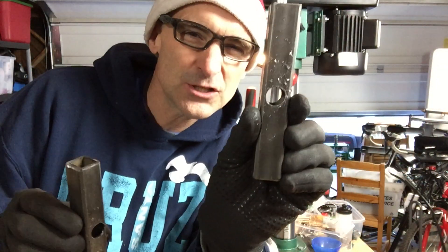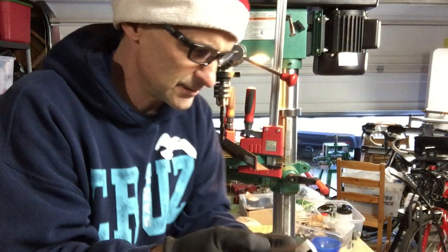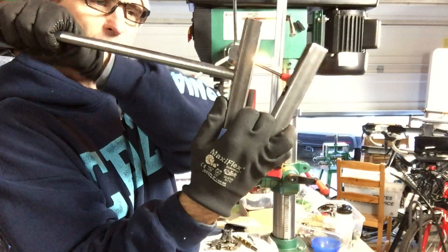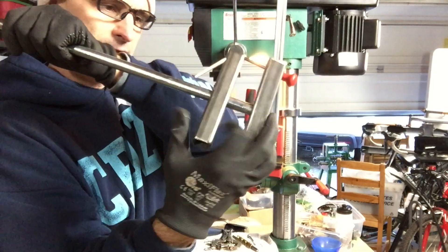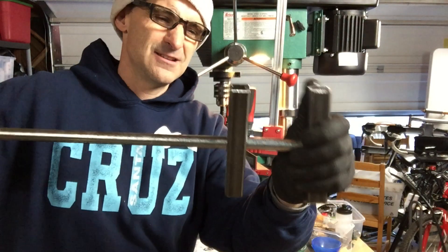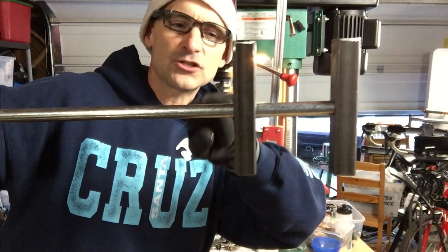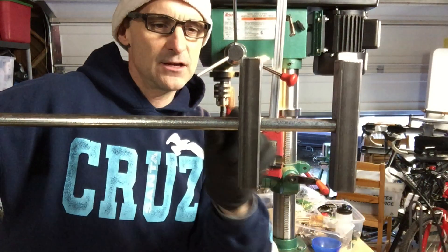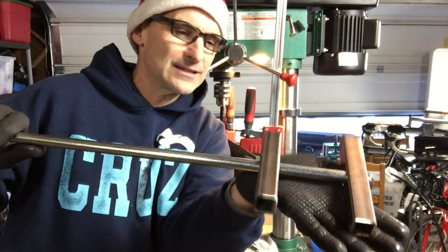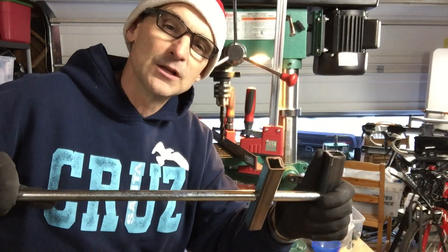This piece goes through and through, and this piece only goes into one side. So when I put this whole thing together I can install my axle through this hole and into this one, and it'll stop at the end. That gives me a place where my sprocket can turn, it's not going to come out this end, and then I can screw a cap onto the end so the axle won't come out. It's a nice simple practical way to attach the axle and make it removable as well.